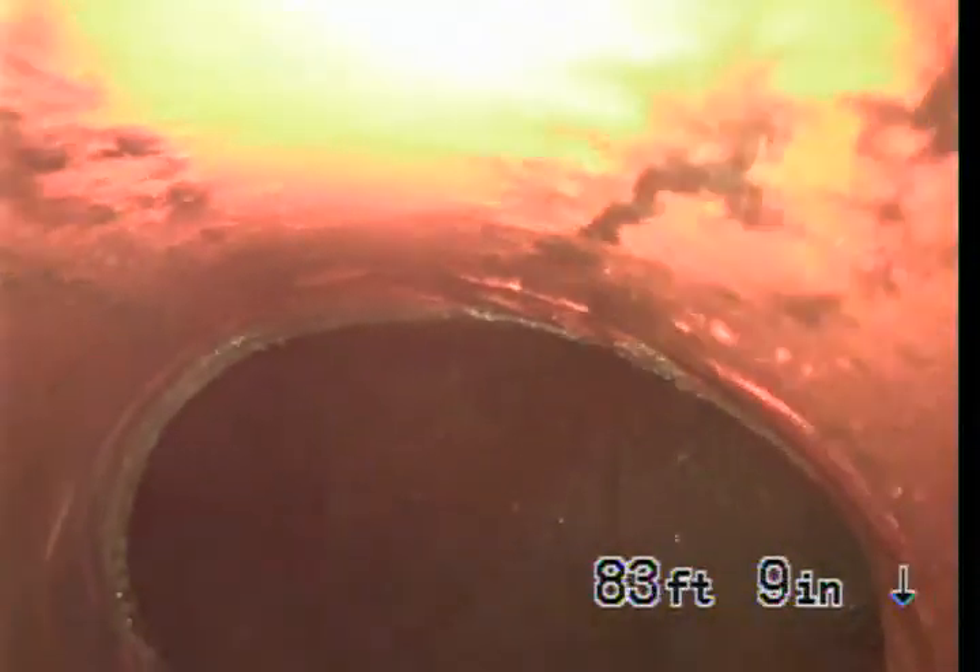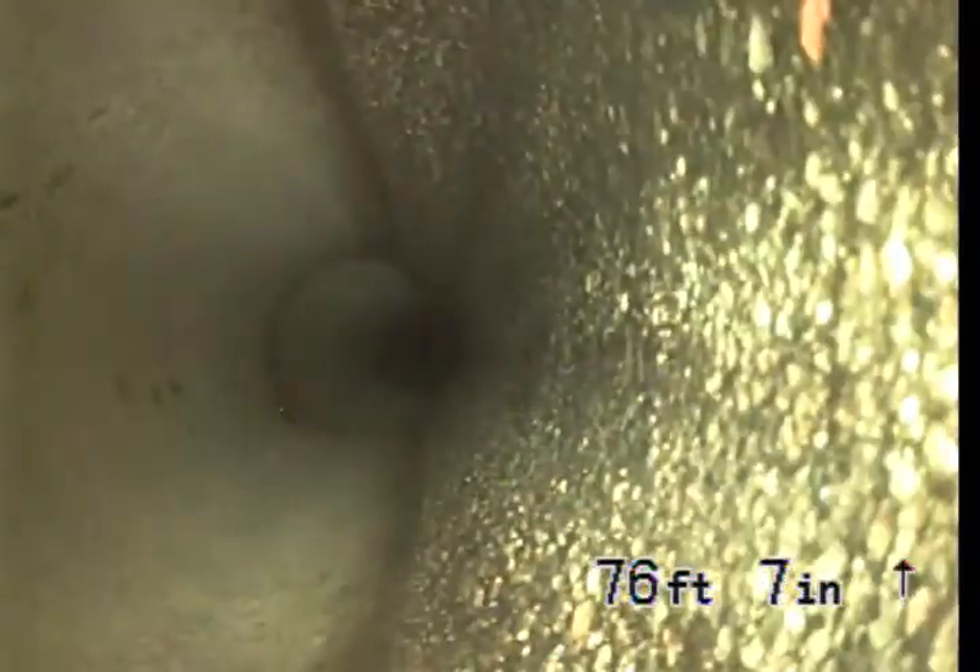We are in the city pipe here, which runs down to the street below. The saddle right here seems to be in good working order. As I pull it back, this is a cement pipe — it's original to the property and seems to be in working order, but because of the material and the age, we would recommend to epoxy line this pipe.